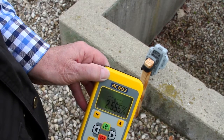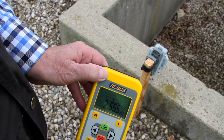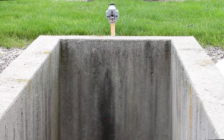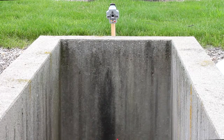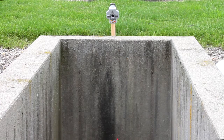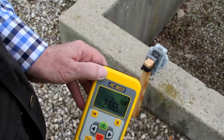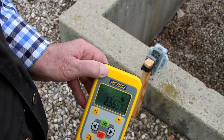A spot finder symbol will flash while the beam becomes a rotating fan beam. The beam moves down to the zero position to check the first reference position. Then the beam starts the movement to the top to search automatically for the SF803 center position. The spot finder LEDs and spot finder symbols on the display indicate the beam alignment process.